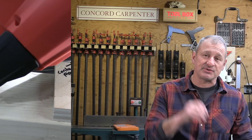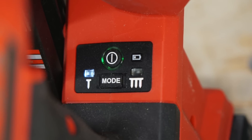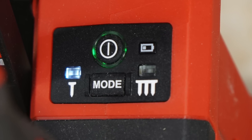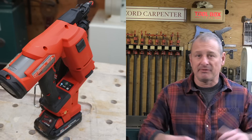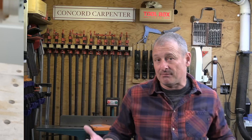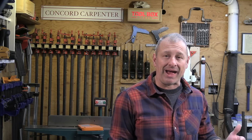The user interface was updated — the power switch and the mode button are now in line, resulting in a cleaner look. They're separate, in line, and easy to use and access. The power button still needs to be pressed for approximately two seconds to power on or off the tool. The Gen 1 required holding the power switch for five to seven seconds before turning it off — super annoying. The tool will power itself off in 60 minutes of inactivity, and a green power indicator light illuminates the entire time the tool is on and connected to the battery.